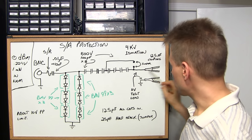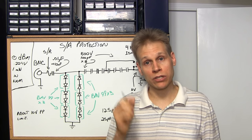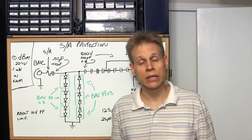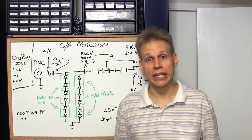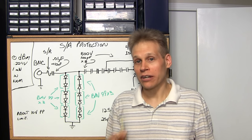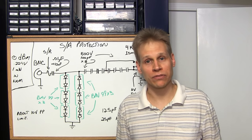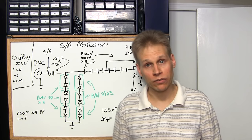This is 4000 volts of isolation from this alligator clip to this part of the stack. I would never test it at 4000 volts because the box is small and the area between the capacitors is very small, so I imagine the breakdown would be a little less. For most receivers you're dealing with a 300 to 500 volt range, so that's not a big deal. I still shudder when I hook the alligator clip up to high voltage — that spectrum analyzer works absolutely flawless and I'm very careful.